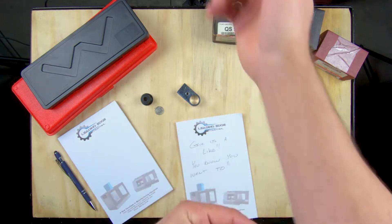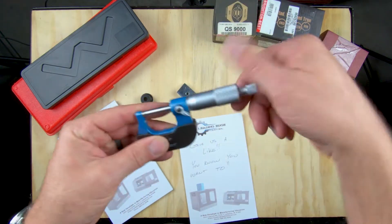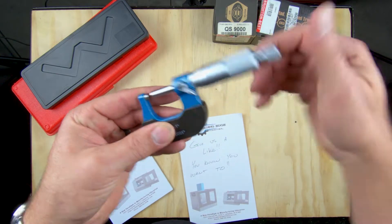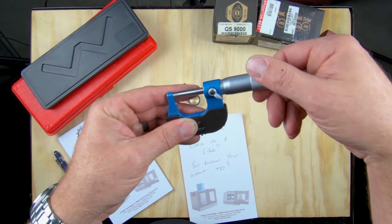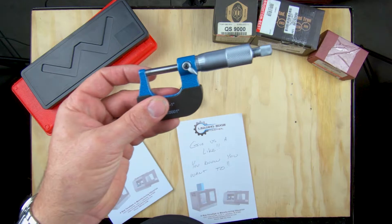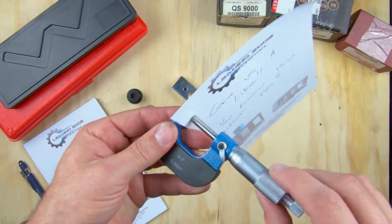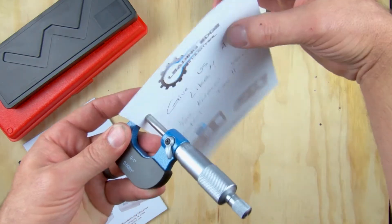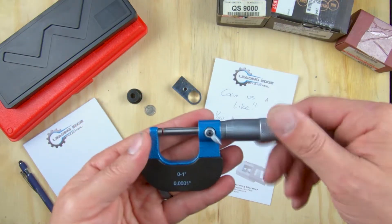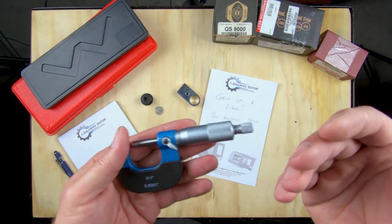When you go to measure, you want to make sure you wipe off the inside jaws. One technique: use your arm to rotate the thimble closed rather than continuously spinning it in and out on the spindle. Never store your micrometer with the two jaws closed — that's not good because of expansion and contraction. To clean off the face, most people use a piece of paper: bring it in close, then pull the piece of paper out — that'll clean the jaw faces off.